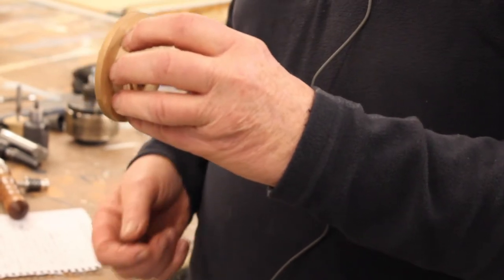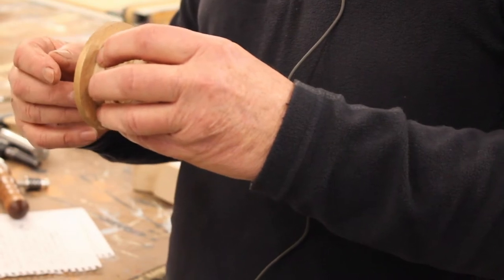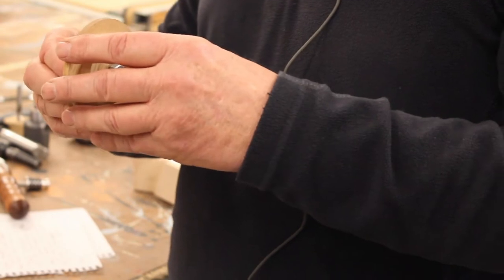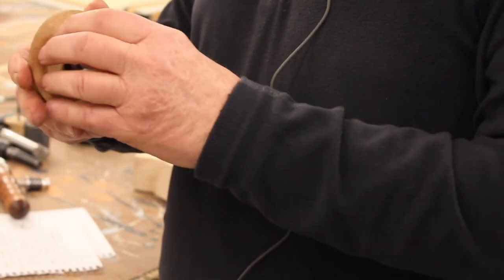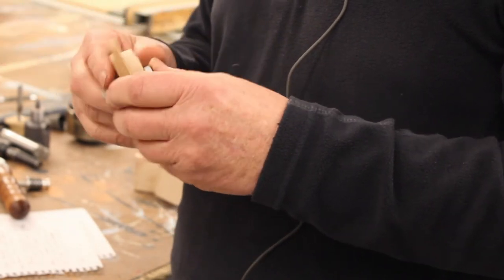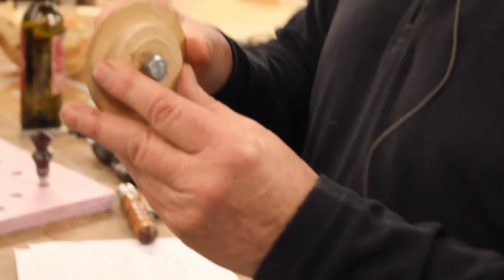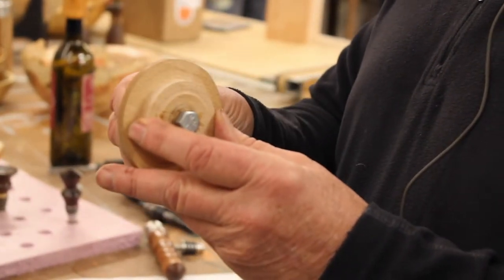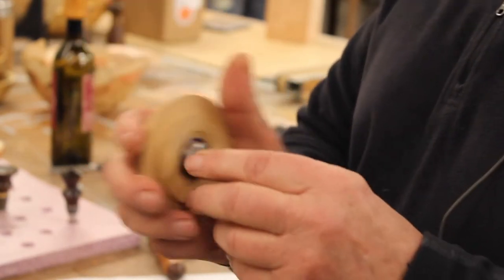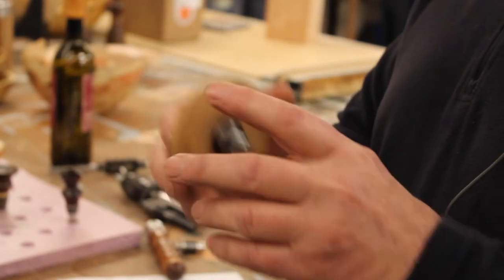Hook your chuck onto here and then drill your hole and cut this on here. The use of that is for turning it around — once you get the bolt in, you'll know whether it's running straight or not. It's not — pretty much guaranteed. So you turn this a little bit into your chuck until it is running more or less straight, then put this into your chuck so it's grabbing it and round this off, and you're going to be pretty close.